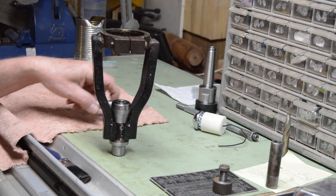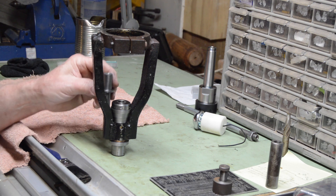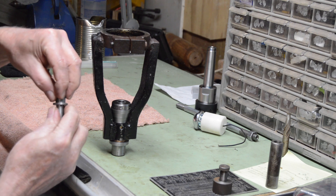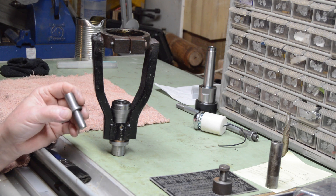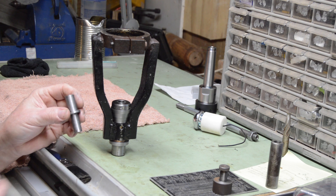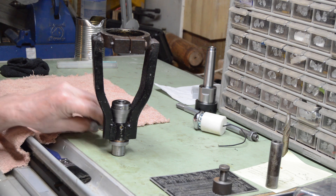It's going to be pulling this piece, and I'll just screw that down into there. Then I'll put the whole cartridge on — I'll have the chuck wide open, slide this up, and this will go inside the chuck. Then I can lock the chuck and make my final lock. That's the plan. I'm going to throw a 3/8 end mill up there and take some light cuts on aluminum, plastic, and wood to see how it works — it's not for rough cutting.